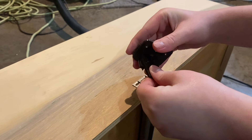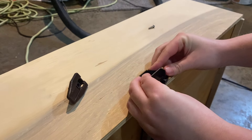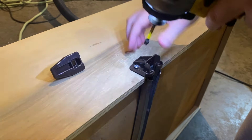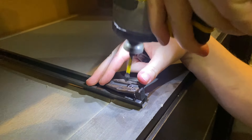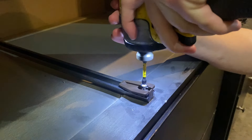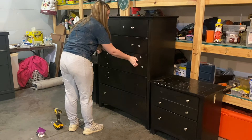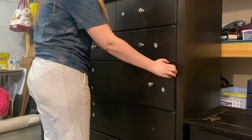It is kind of a two-part process. We're going to pull the two pieces away from each other and use just that bottom piece for now. It's just like the one we removed, but this time we're screwing the screws in, which means you should be able to use the same exact holes. Once that piece is on all nice and tight, we can move on to the second component. Here we are dealing with the drawer slide itself. All you have to do is unscrew that screw, then plop the new piece in and it should click right into place, then screw it in tight. At that point you should have a fully functional drawer slide that slides nice and smooth and keeps your drawers up. I love when things are easy — this was so easy and I'm so glad these drawers are working now.